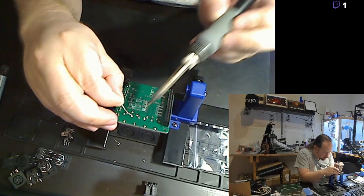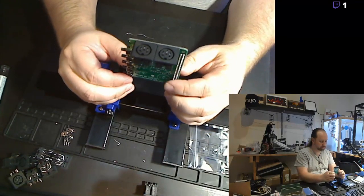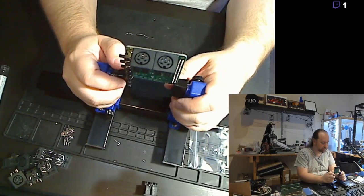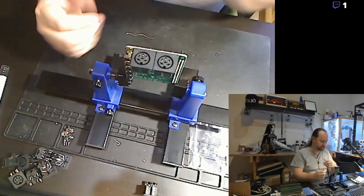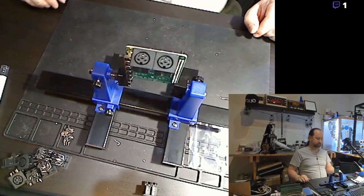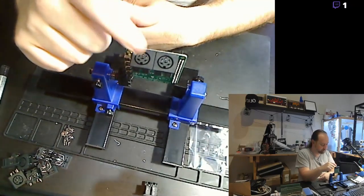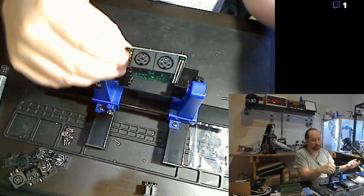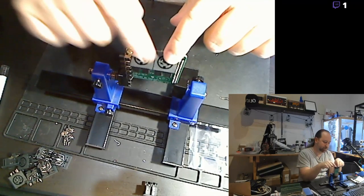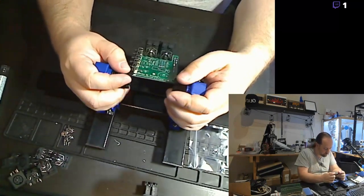And the last one. So both the serial ports are mounting. Essentially, the C64 serial ports are daisy chain serial ports. They're all just passed through, sitting on the line, so you can plug your floppy drive into your port, and you can send out the signal. You can connect the Commodore 64 here, thinking it's a floppy drive, and then you can connect your printer, like a serial printer, out to the other one. Right, so.